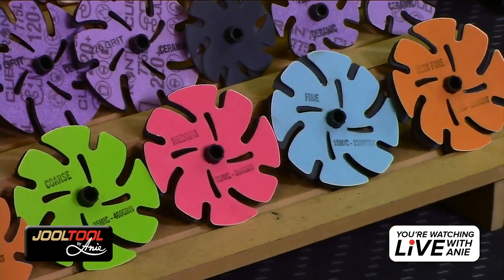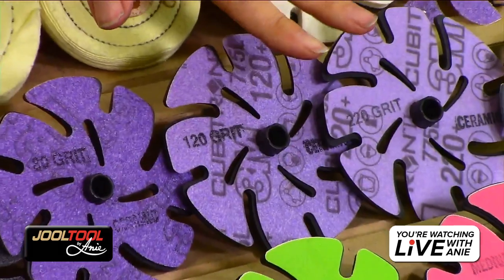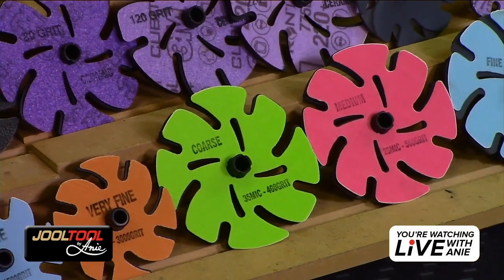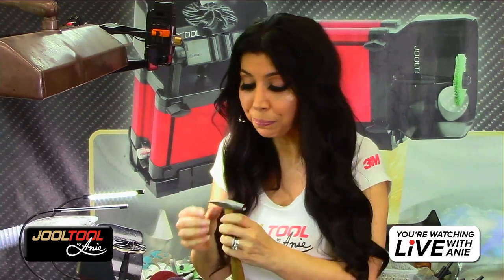And then if you want to roll the corners down or even change it to be really, really round, then I recommend to not waste your Trizact and go to the purple for shaping. Remember, purple is always going to be your workhorse for shaping. I wouldn't use the Trizact for shaping. It's unnecessary. You're going to waste a beautiful abrasive and use it for purposes not intended. I repeat, Trizact is not for shaping. Mild shaping, yes, and getting rid of a sharp edge, a quick little kill the edge is what we say. But if you want to totally change this, it'd be different.